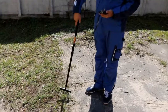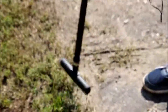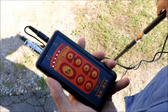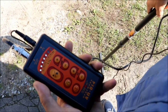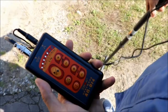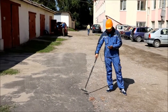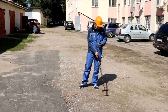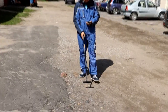Take the receiver and EMD sensor and start surveying the area. Position the sensor as an inverted T-letter towards the ground. Slowly spin the sensor in order to spot the utility direction — the position with maximum signal will tell you which direction to trace your cable. After that, slowly move in the direction of the utility, slowly swinging the EMD sensor from side to side, monitoring the signal at the receiver face panel.